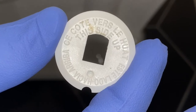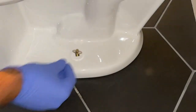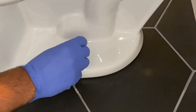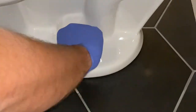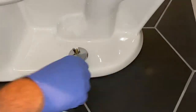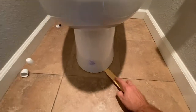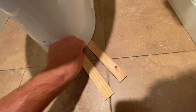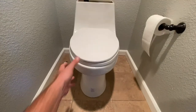We're going to install the toilet cap washers — make sure the writing is up where it says 'this side up.' Then put a metal washer on top of that, and then the nut. This toilet came with wing nuts — both regular nuts and wing nuts are fine. Tighten each wing nut until snug, one on each side of the toilet. If the toilet has a slight rock, you can shim it using a wood shim — pound the shims under the low point, score them with a razor knife, break them off, and the toilet should be nice and sturdy.